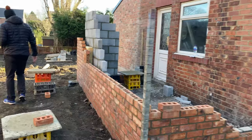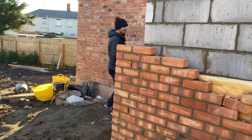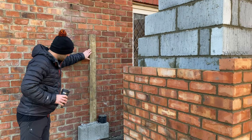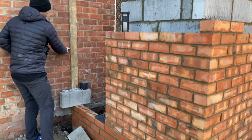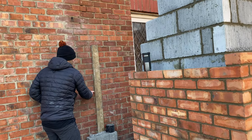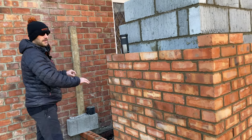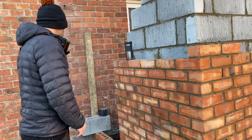Follow me, Keegan. We've put on the back wall here, we put a bit of timber on here. This is just temporary because you can see there is a door going in here. But again, same as the starter bar on the front, we just pin in here, pull our line across to the profile. That means that we don't have to build any pillars.